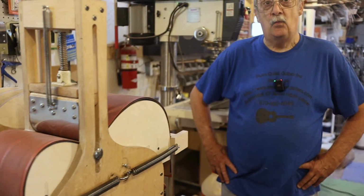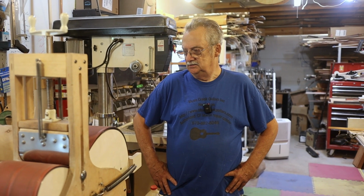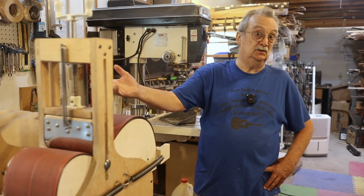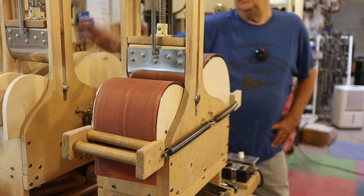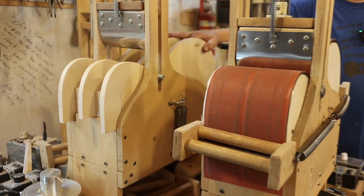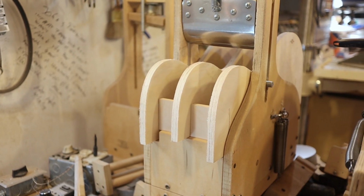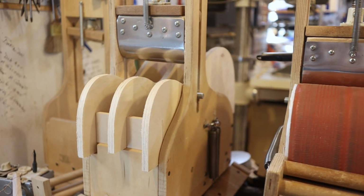When they say don't reinvent the wheel, are we really reinventing the wheel here? We aren't really reinventing the wheel. The original design called for aluminum slats, which I've been replacing with stainless steel for 20 years. And what happens, I found that this middle rib, some woods, especially flat sawn, will want to cup. This helps to avoid the cupping issue. So it's things that you've learned through the years, how to do things just a little bit better.